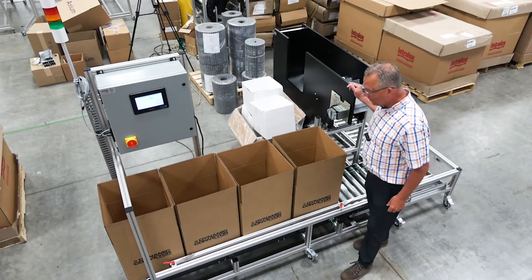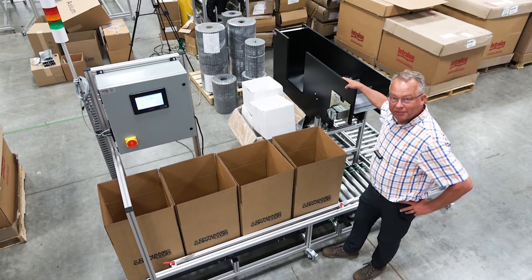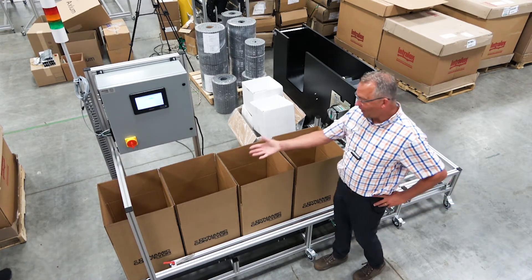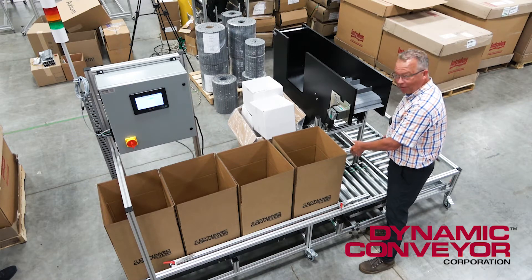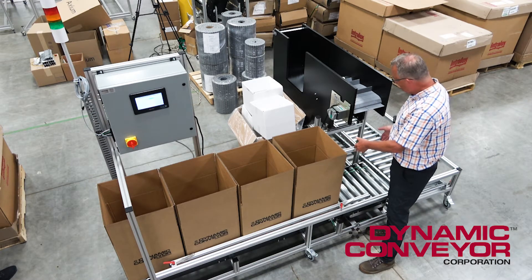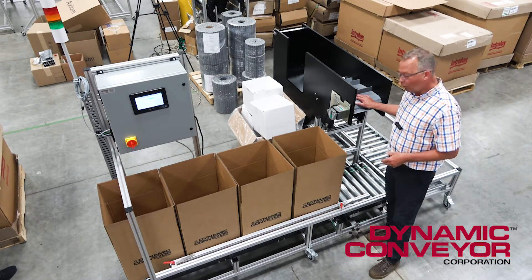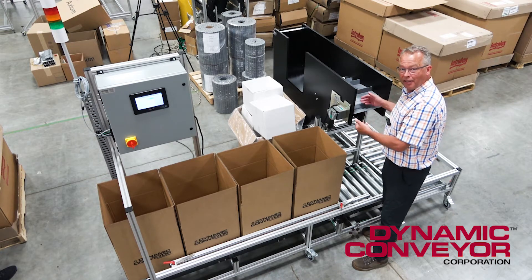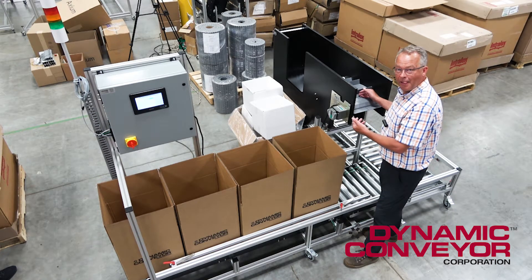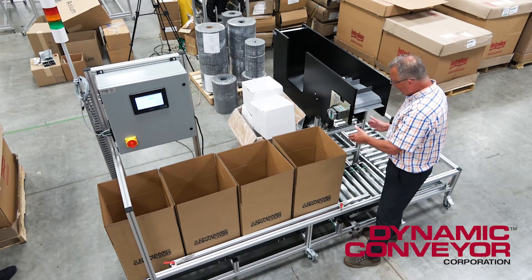Hi, my name is Paul Kaharvitz and today I want to show you one of our box filling systems. A box filling system is clearly something where we take empty boxes, feed them over to a scale, set the set point that's desired. When we hit that set point, it'll move over and go down. You'll see a faster feed in the beginning. As we get closer to set point, it'll slow down so we just trickle them in and then we'll get that exact count and move them.